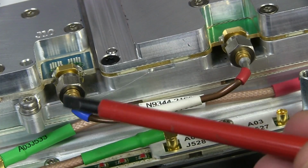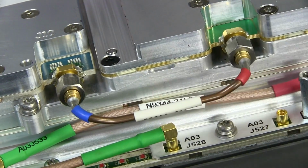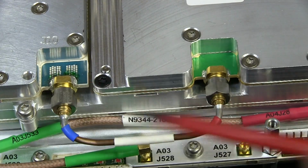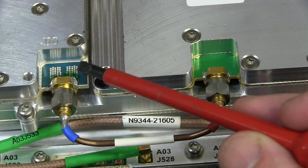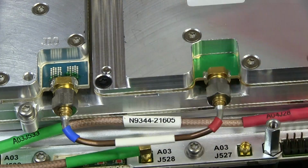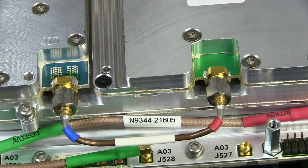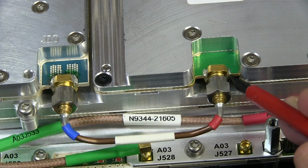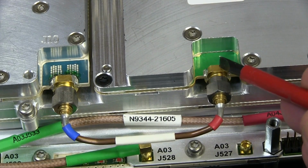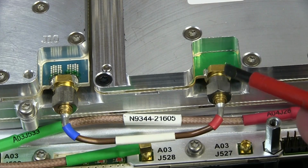So they've got that rigid coax. That'll be like 20 gig bandwidth or whatever they need. There looks like they've got SMA connectors on there going from board to board. Look at all the vias on there. Look at all that via stitching there to get the impedance right and the inductance right down. So fantastic. And they've got center mount board connectors in there, mounted right on the center, so the pin that comes out, we'll probably see that when we take the board out.